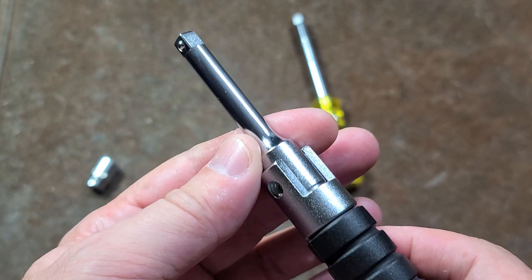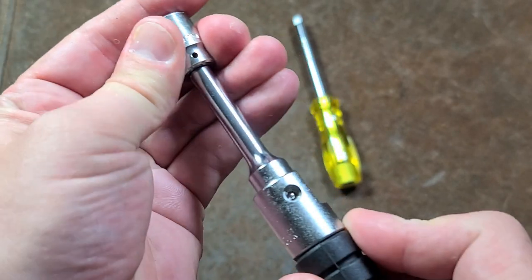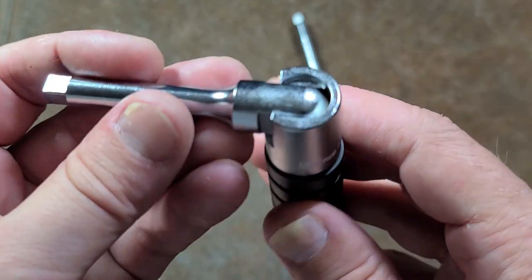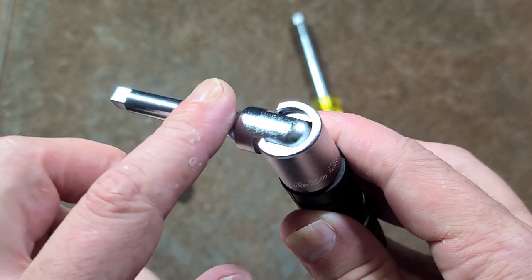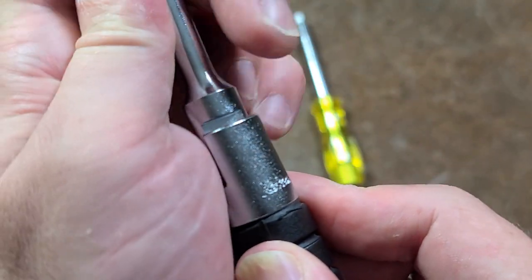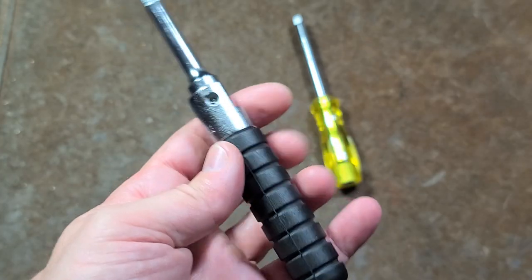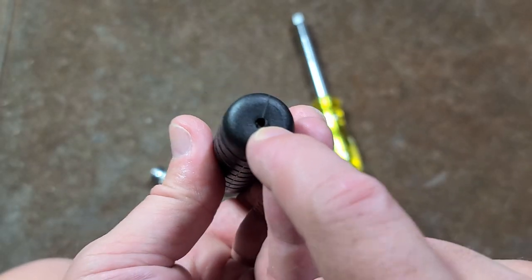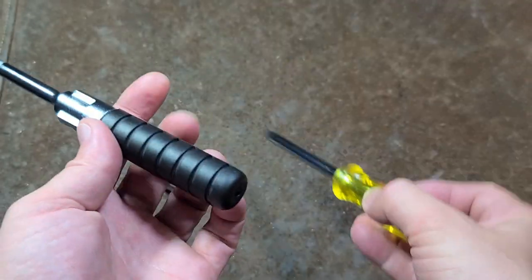The detent is pretty strong because it's designed so you can pull a socket on and off without the tool extending out, but unfortunately that makes it really difficult to pull out in a lot of situations. The quality otherwise is great - really super tight, well above quarter-inch thick steel, no worries about strength. I also like the detail of the undercut that lets the stem sink in and stay tight when folded. I am wondering though why they did not put a quarter-inch drive through-hex receiver on the end so you could also use a ratchet.